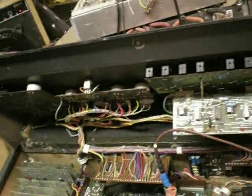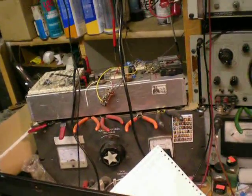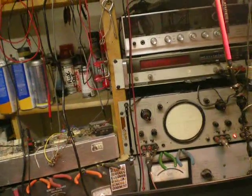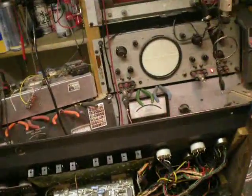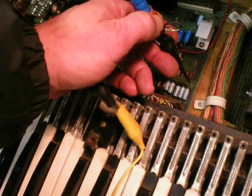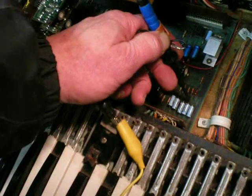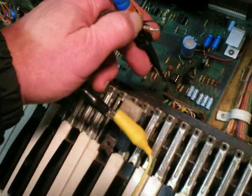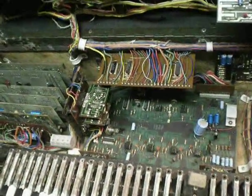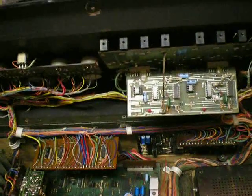So that's what you expect on the outputs on this one. The DS2 has that on the circuitry. I think we got most of it figured out, but I'm still not sure why the dual resolution. We're going to see how the wave shape converter varies on those two, or if maybe there's a missing data bit — could be. There are five inputs total: DCO1, DCO2, noise, poly section, and an auxiliary that isn't being used unless you hook a jack to it for an external input to the filter and VCA — which would be a fantastic thing to have.